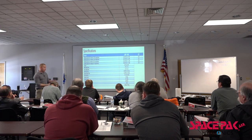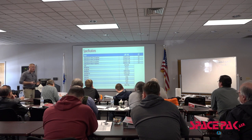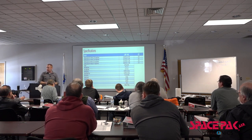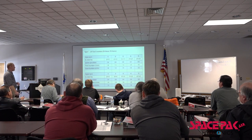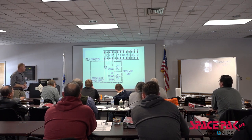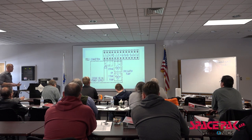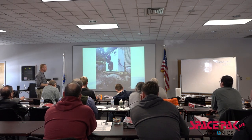So if our water temperature is 60 degrees coming in and it's 70 degrees going out, we're not gonna take 60 degree water and make it 110. It's gotta go through the system multiple times to make that happen. Glycol again. Wiring again is very similar. I love these slides. It really makes you think about how your eyes are. But just the same, we've got 230, 240 volts in, and then we control our circulator pumps as well just from that unit.